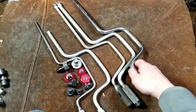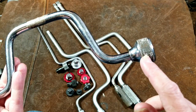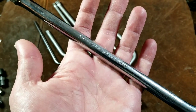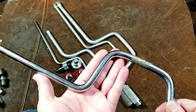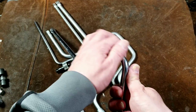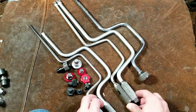They are based off the hand crank method. Here's a closer look at a Proto — it has a bent handle and a knob that spins. It's not on bearings; it's just a rounded end piece of steel with a cap, swaged or crimped down so it doesn't fall off. The offset is pretty universal: about three or four inches on a quarter-inch drive and five inches on a half-inch drive. Most half-inch drive bolts will be very difficult to break with this because you don't have a lot of leverage.